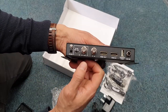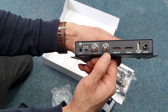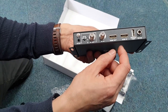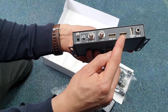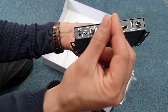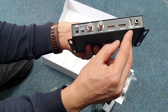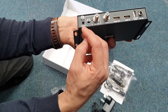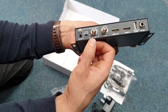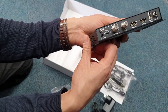So this is the actual modulator. You can see it's got the RF in, so you could put your aerial signal into there first, then your RF out — that's the signal going to your remote TV. Your HDMI in, so if it was your skybox you'd put your skybox into there. And on the TV where the skybox is, HDMI back out to that television. 12 volt in, and you've got your service port there to update the device, which they do say it's better with an update. It's got the infrared out there as well, and your 9 volt power for the magic eye, so your remote control will work over the coax or aerial distribution.